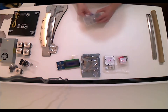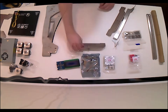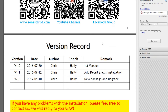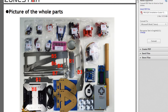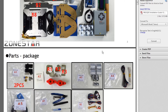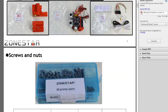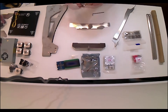The SD card also has a few sample gcode files with their respective STL files, as well as instructions on how to assemble the printer. The PDF assembly instructions that come on the SD card aren't very helpful, but they do provide some QR code links to YouTube videos that seem to show the full assembly in greater detail. I didn't bother to look into the videos when I was building it, so I pretty much just used a system of educated guesswork and reading through the instructions until I got it built. If you're planning on building this printer, I recommend getting a QR code scanner for your phone so you can watch the videos. I also forgot to install the auto bed leveling sensor before I wrapped the X carriage wires, so I'll need to go back and do that at some point.